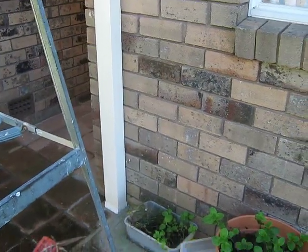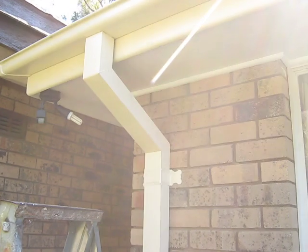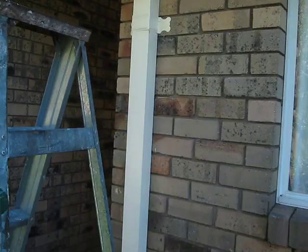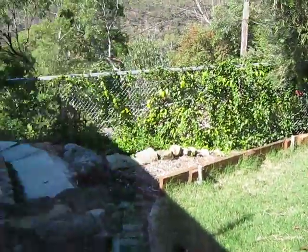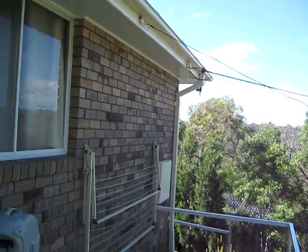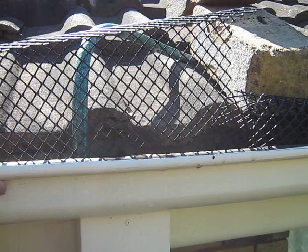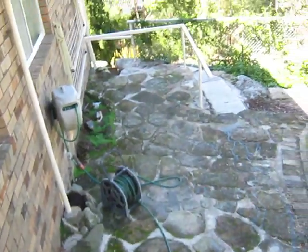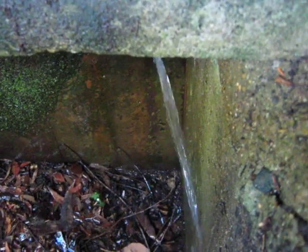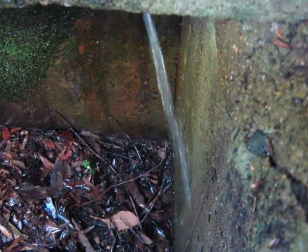What I'm going to do now is test the drainage system at the back of the house with a hose. I'll measure the water going in compared to the water going out at the outlet for this drainage system here and the other one over there. You can see the water going in, and at the outlet the amount coming out is a little restricted, a little bit blocked, but it's not too bad compared to the other side of the house.